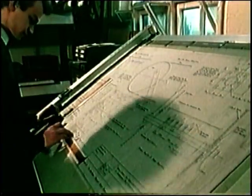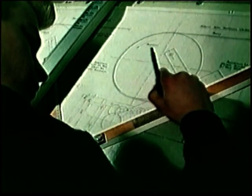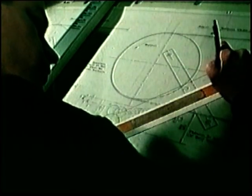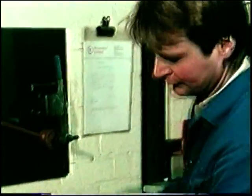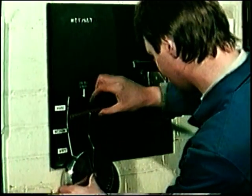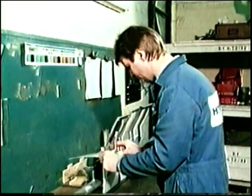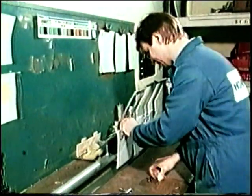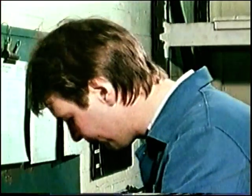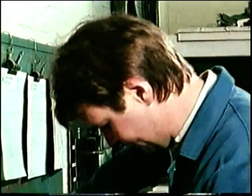The design of the scraper ensures the blades keep perfect alignment and are in contact over the full width of the belt. The heavy-duty rubber torsion mounts withstand high impact and are self-adjusting to compensate for blade wear. Tension of each arm is checked to within the accepted tolerance before assembly. This T-type scraper is made to suit individual drums, even catering for crown drums when necessary.